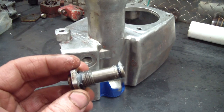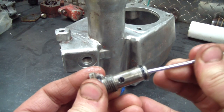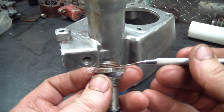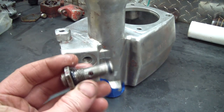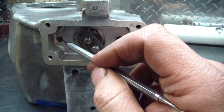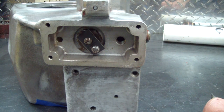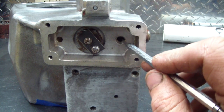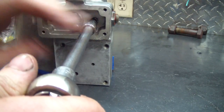Here I'm getting ready to install the check valve. Inside there is a spring-loaded ball, and the instructions say there should be two to three threads showing after the jam nut, so I'll screw it in as such. There is what they're calling an expansion plug in this casting and I didn't bother removing that — the passage back to the reservoir was clear. There is a threaded plug that will be installed here to cap off this oil passage, with just a dab of Teflon paste on it.